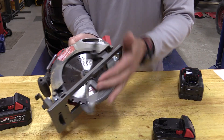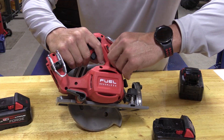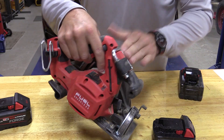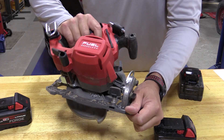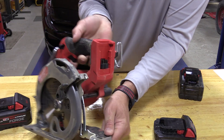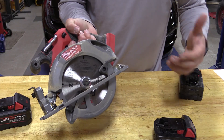When we take a look at this tool, we have a nice metal guard at the bottom. It does move around a little bit but is easy to handle. Easy to get out of the way to remove the blade. The tool to remove the blade is up here in the handle — it's tight, not going to fall out, but easily gotten to when needed. You've got a rafter hook, a belt hook, and an ambidextrous safety arbor lock. It bevels to 50 degrees with detents at 45 and 22 and a half. It'll take a fence on either side, and you can feel the detents at each listed position. Very smooth, very easy to use saw.